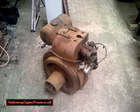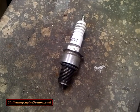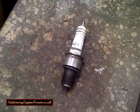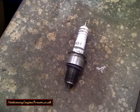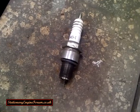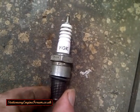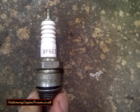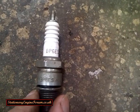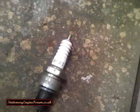And that basically is how you time a Petter A1. Another thing to note about stationary engines is getting the right spark plug. I've had a bit of trial and error with Petter A1s and different spark plugs. The one I'm using at the moment has a fairly long thread on it — it's an NGK plug, model number BP6ES. I believe this model is still available from car parts shops.